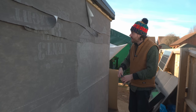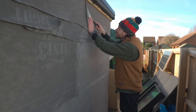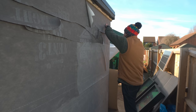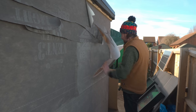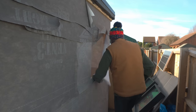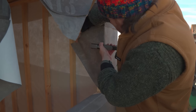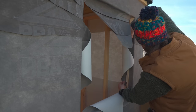The windows are put together now so I can get them installed. I find where the opening is and get the knife in to cut through the membrane from corner to corner. Now I can grab the staple gun, fold these flaps in, and staple it in place. Any excess membrane can then get trimmed off.